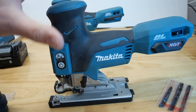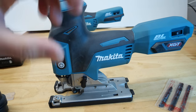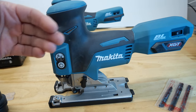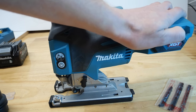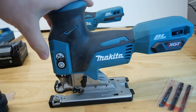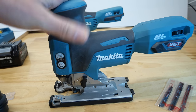Now, I'm assuming it's going to be like that everywhere, but it might not be. But hopefully Makita have made all the 40 volt ones the same, so that you can turn it on or off. And to turn that on and off, make sure your tool is turned off. Put your dial on 1, it goes from 1 to 6, of course. Turn on the tool, not running, just unlock it. Better put on a battery, eh?